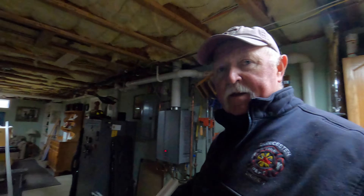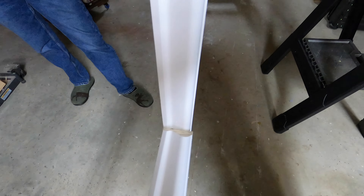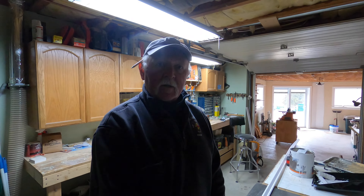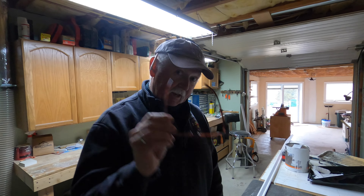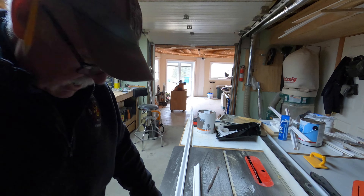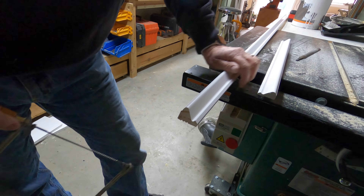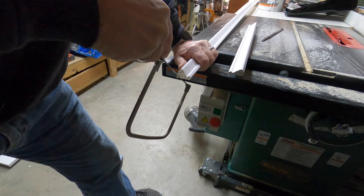I'm in the middle of cutting this cap. When I get to an inside corner — what I mean by that is a corner like this — some people will make two 45-degree miters and join it, but I'm going to show you how I cope it. The first thing I did is cut it at a 45-degree angle so I can see the contour. Now I'm going to go ahead and cut along the contour of that cap, but I'm going to do a couple of relief cuts first.